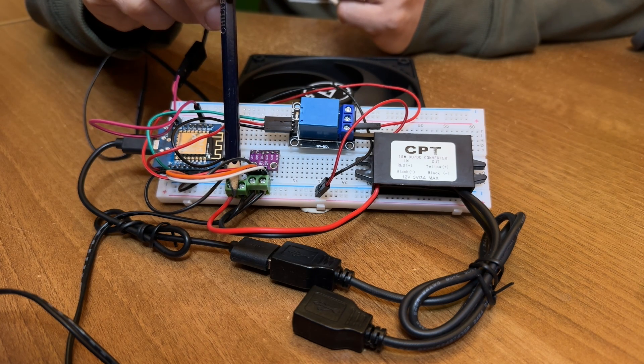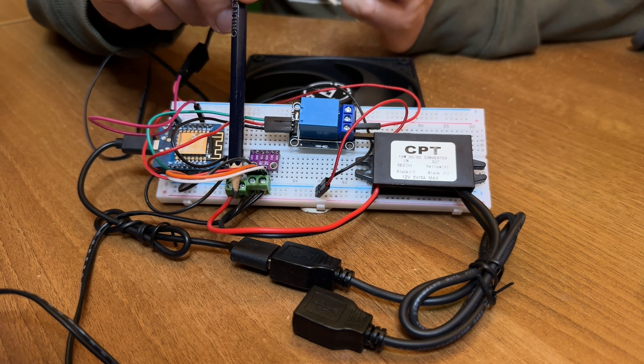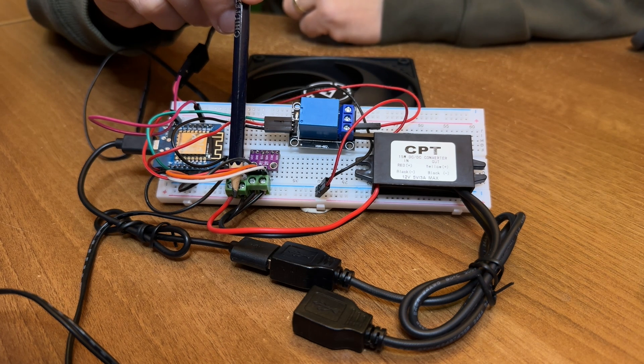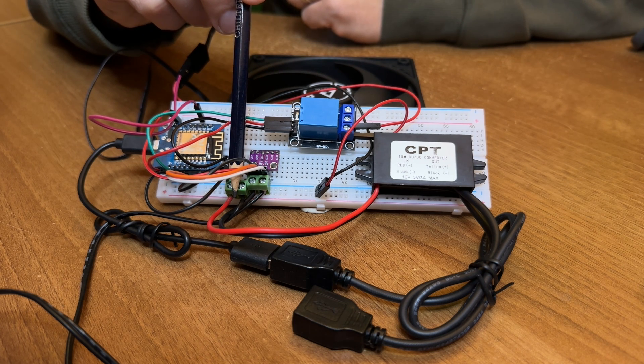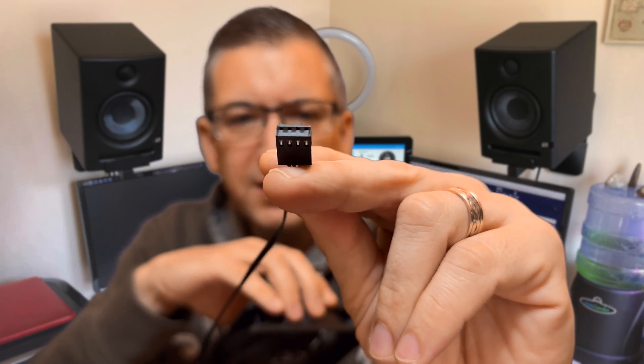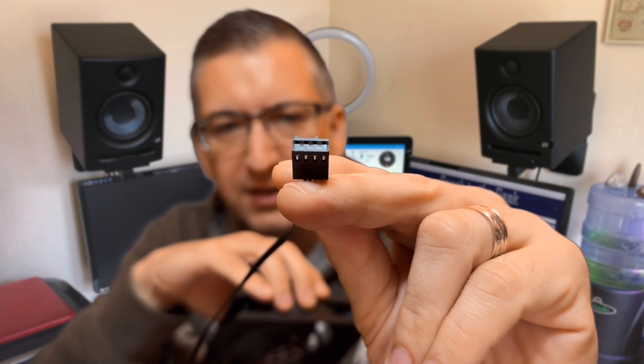Let's start with the power supply. I'm running this project using a 12V power adapter. I've cut off the barrel connector so I can screw the cables into these green terminals. Make sure you note which wire is positive and which is negative — usually the wire with markings on is positive, but make sure you know using a multimeter, or sometimes there's a diagram on the power supply's label. This is a 12V fan made by Arctic — I'll put a link in the description — and specifically this is the PWM version, or pulse width modulation. That means it has a 4-pin connector, which is important because that 4th pin allows you to signal to the fan how fast you'd like it to spin.